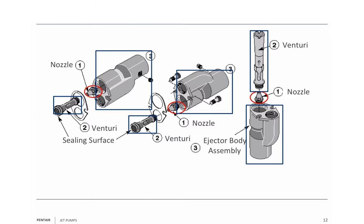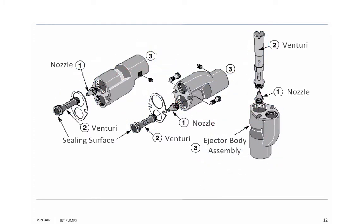The vertical picture is a deep well jet. The middle picture and the far left picture are shallow well jets — they attach to the front of the pump in a horizontal position and are good to about 25 feet. The picture on the right is a deep well jet, and deep well jets can go considerably deeper. It depends on the horsepower of the pump and the nozzle and venturi combination used. It is very important that you use the right jet with the right pump.